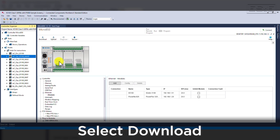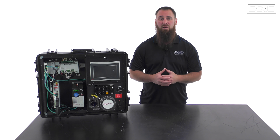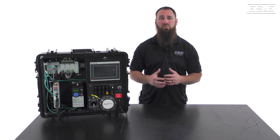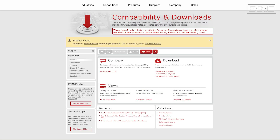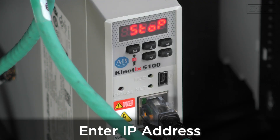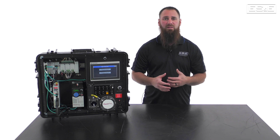Now we need to download this code for both the PLC and the HMI in order to prepare to run the Kinetix 5100. If you wanted to set up the drive first and run it from its configuration software, then you would want to wait until the end to download to the PLC. Next, we will need to configure the Kinetix 5100 drive, which requires the KNX 5100C software to be installed on our computer. If you do not have that installed, get it from the Rockwell PCDC. Once the software is installed, we need to assign an IP address to the drive, which can be done with the keypad on the front of the drive or through the KNX 5100 software.